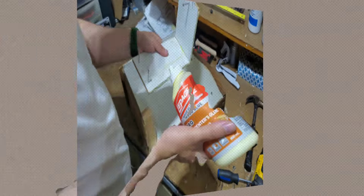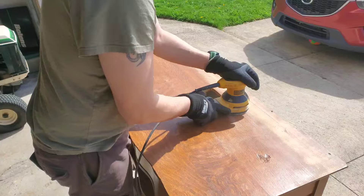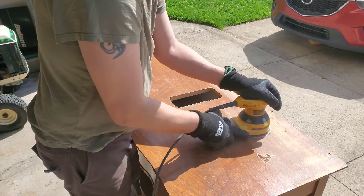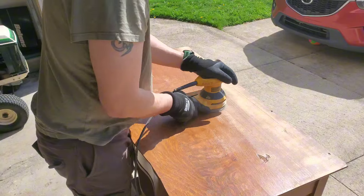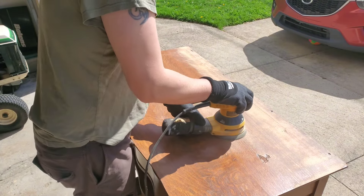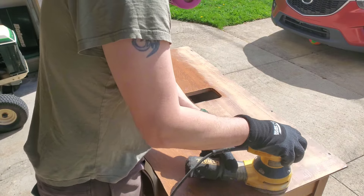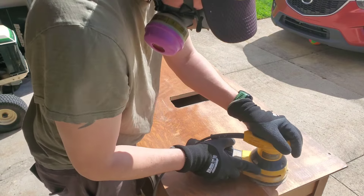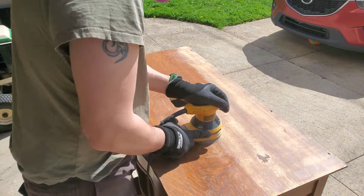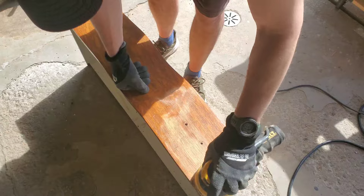So while this was left to dry, it was time to start sanding. We'll be sanding just the top of the dresser as well as the drawer fronts — basically the areas that had visible damage on them. We really wanted to clean them up. You will see that Julian is holding the sander firm up top, but he is never pushing down. Make sure not to push down on your sander. Starting off on the drawers here.